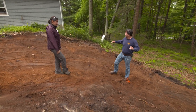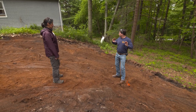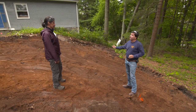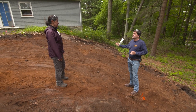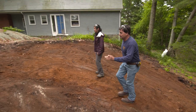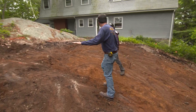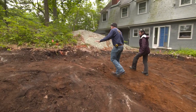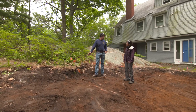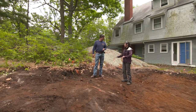Right here is the corner of the garage. This is probably the level of the garage floor. We're going to have a wall here. We're going to go down about four feet below the earth here and pin our new footings and foundation to the ledge. And across the whole front of our garage right here, we carry that same line down for the depths. We're probably going around three or four feet here. And we don't have to go down too far below the frost line because we get to pin to the ledge. So we don't have to remove that much here, just enough to get the foundation in.